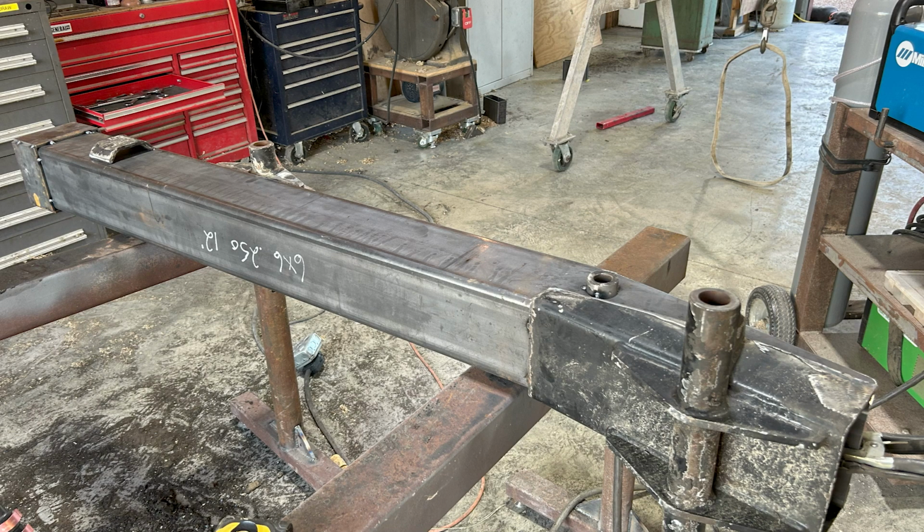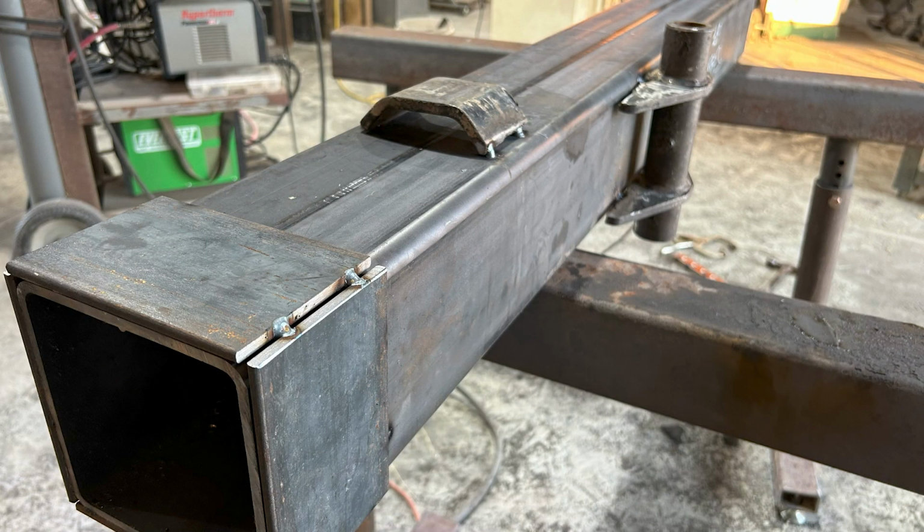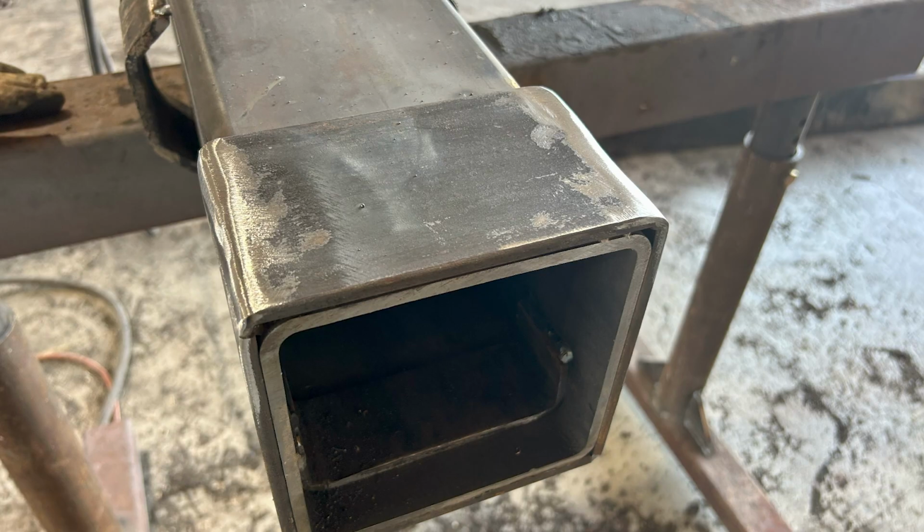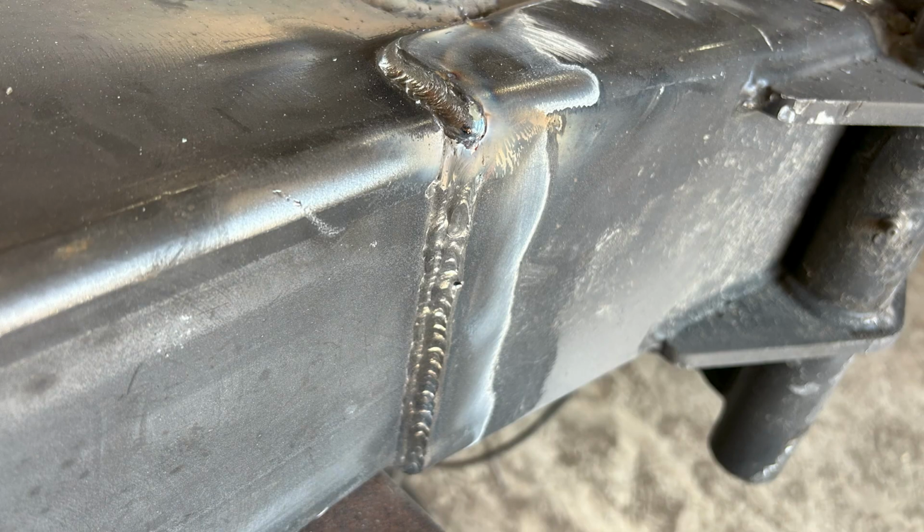Somehow I managed to take pictures and not video of the welding, so you get snapshots of the work as I went, but no actual welding shots. I welded up 4 pieces of flat bar into this collar, and then ground off the edges so they were round. Here's the main pivot bracket all welded up,